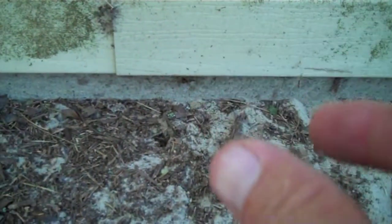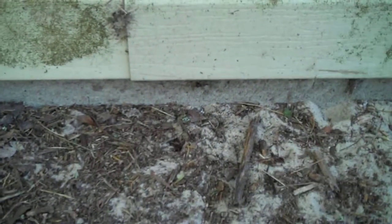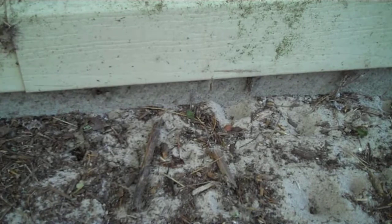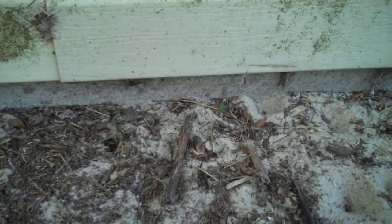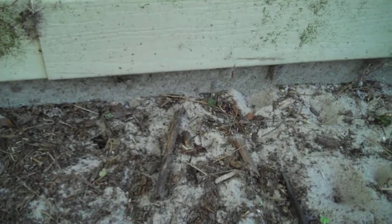But the other thing I'm looking for is cinder blocks and hollow blocks, bricks in general, always have that little seam whenever they put them together and mortar them. So I'm looking for little seams about every 8 to 12 inches, however the blocks are usually about 12 or so inches apart, and you can see the mortared seams, and I don't see any of that. But in this state the guys that build these homes are quite good at hiding those seams with stucco, so we can't rely on that alone.